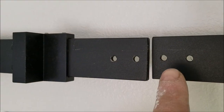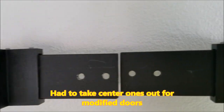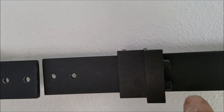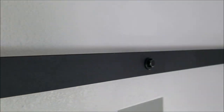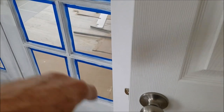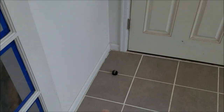Before you tighten these up, before you put this on, slide the door stops in first. If you've got two doors there'll be a right, left, center — make sure your set screws are on the top and your bumpers are on the doors. This house is kind of small square footage wise. They had French doors but didn't want them banging into each other or swinging out into the living area, which is now the kitchen. They didn't want the door banging into the entry door, so I put a floor stop down there.